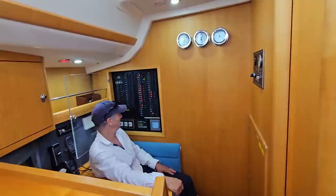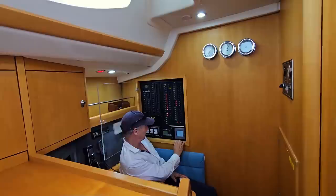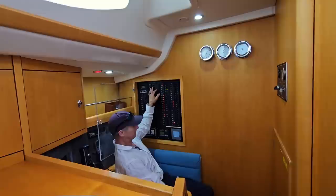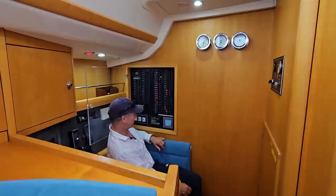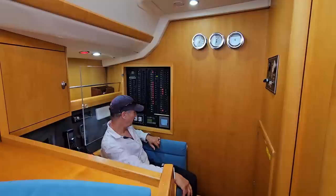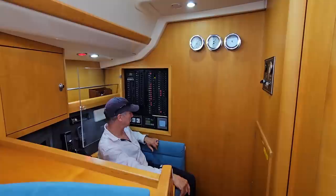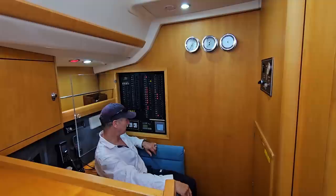To continue the process once the generator is running, we turn off the inverter and then go ahead and turn on the battery charger. I'll go back to the master volt monitor to see what's happening. Once the charger kicks in, the amps will jump up to around 60, usually after about 12 hours of inactivity. She's loading up now — creeping up on 60, 59, 60. There we are.